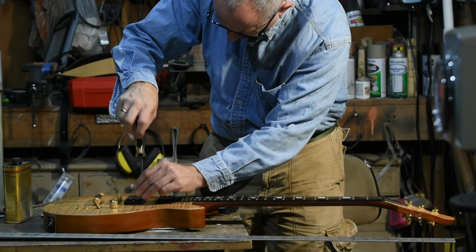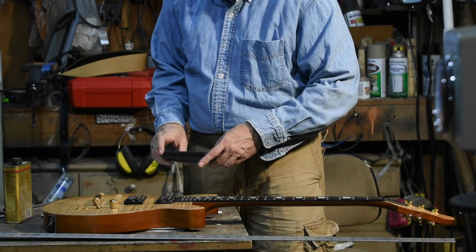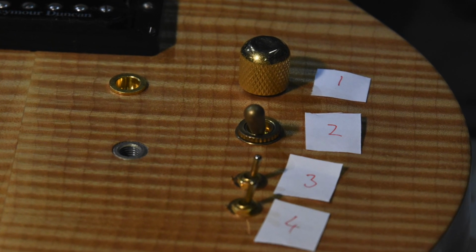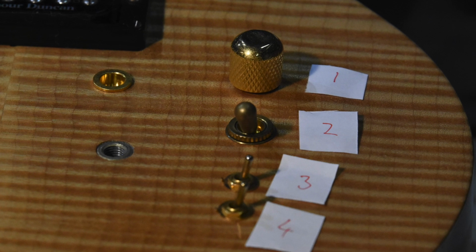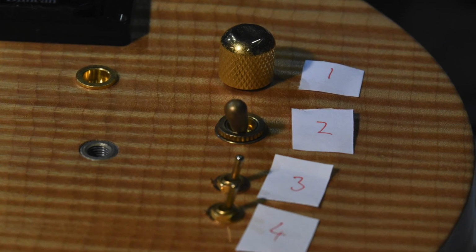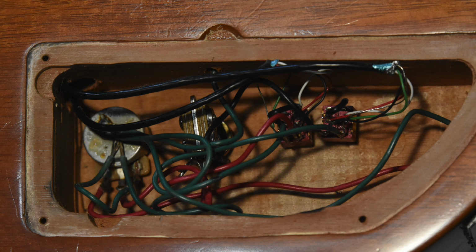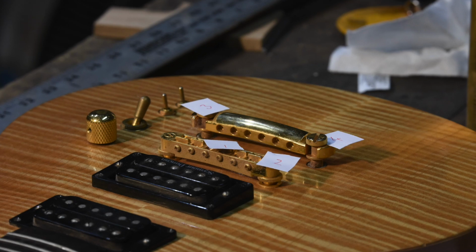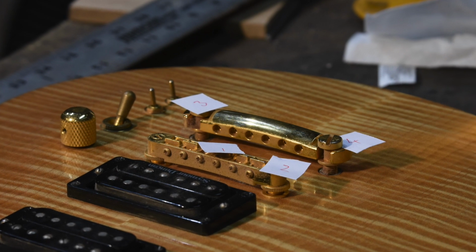I began by stripping the guitar down to parts, labeling everything carefully as I went. Naturally, I couldn't be reasonable and wire this thing normally. I had to make it with coil taps and out-of-phase switches and no-tone pots and a bunch of non-standard stuff that I frankly couldn't even remember anymore. So I had to label everything in order to have any hope of reconstructing it in functioning order.